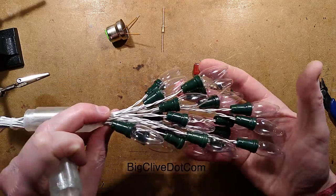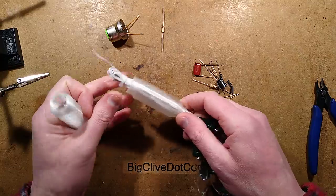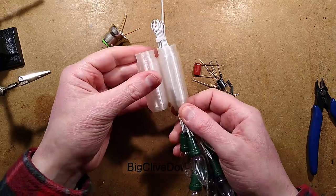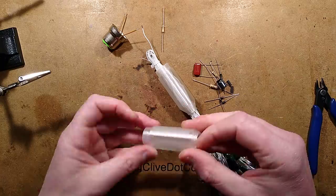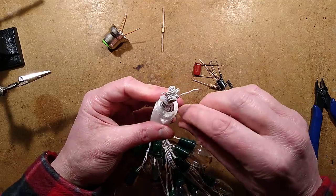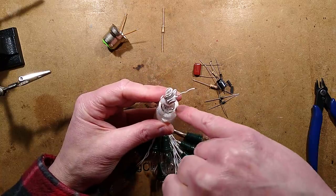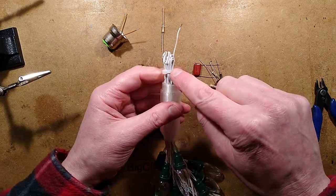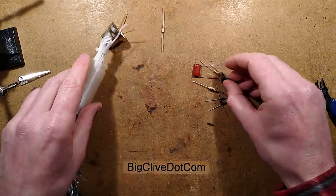That's the cluster made - it's looking pretty good. I've also successfully 3D printed the bit that's going to go into the lamp base, after several attempts. One got so far it got almost to the end and then detached from the bed. Ended up increasing the bed temperature and also thickening up the base, then adding a flange afterwards just to make sure this one was a success. That means there's a bit less space in there for getting the electronics in.